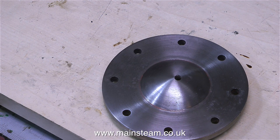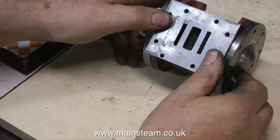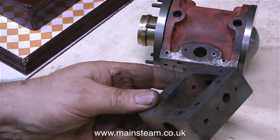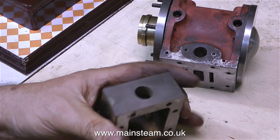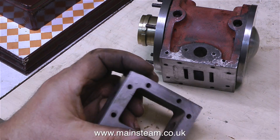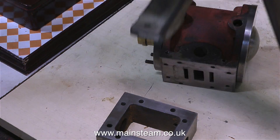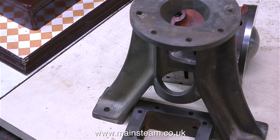I gave the top cylinder cover the same treatment — I didn't show it because it's just a repeat of what you've just seen. This is the steam chest. I removed the gland fitting and the top cap, and at this stage it's just as it came off the belt sander. It still needs a little more work, but no more belt sanding — it's handwork from now on, on a piece of sandpaper on the surface plate. I have a kit of parts that are quite nicely machined, and the rest of the castings and parts are now on order from Stuart Models. But that's it for now — thanks for watching.